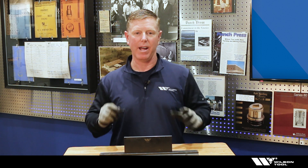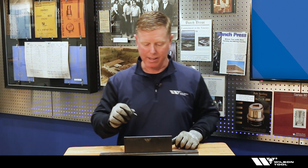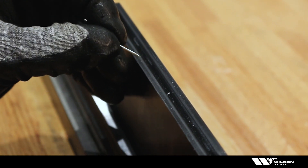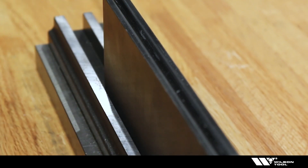Let's take a look at a second scenario. This one isn't quite as severe — we don't have the buildup and marking on the material yet. It doesn't look like a bad die, but if you look at the bottom of the v-opening you'll see there's a flake and some other debris, and maybe a white line at the bottom that looks like it's starting to build up, but it's not so bad we have a chance to clean this die and not have problems.